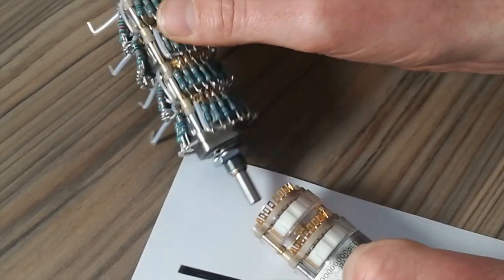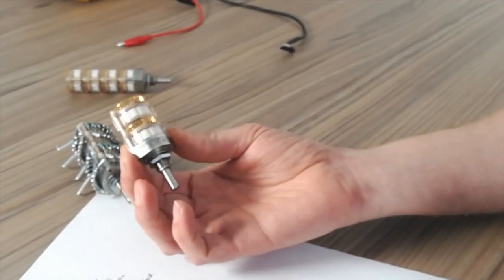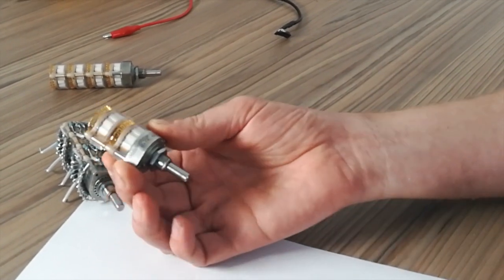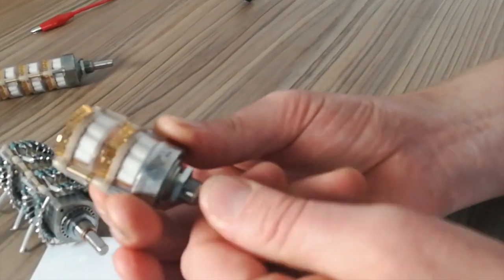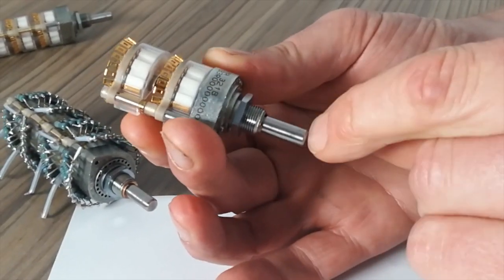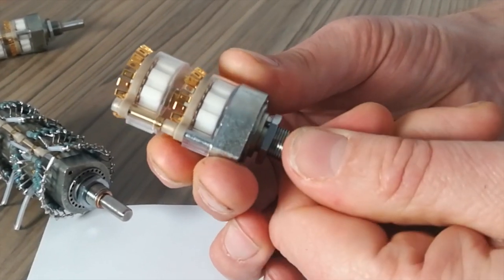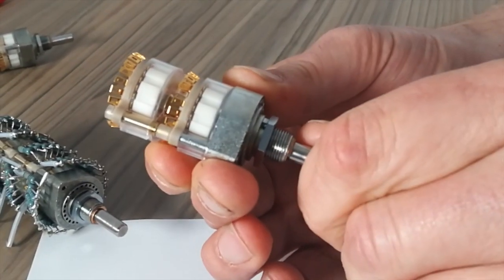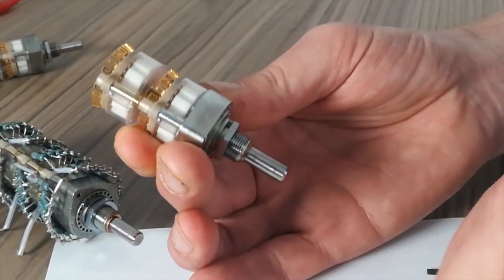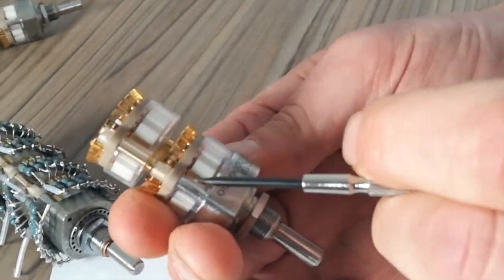Okay, now the slight problem with these switches is you have to take them apart in order to build them. So rule of thumb for us is we have it on the lowest volume, so all the way there. Do not touch that switch. Don't turn it while you're in the building process, because if you move it like that, you won't be able to put it back on properly. You take it off and then you move it like that, it's just confusing. So always keep it low volume. And then you can see that's there.